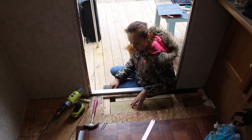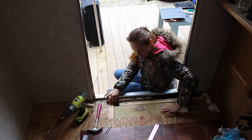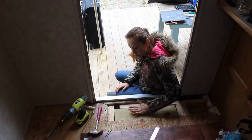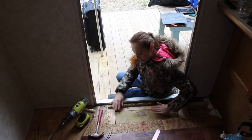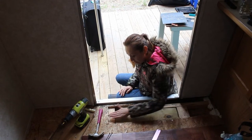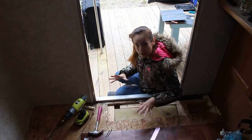In order to fix our problem, we put a brace underneath these two joints here and then added this piece of wood so that when people step onto this plywood piece it's going to help with weight — it's going to distribute the weight more evenly and we won't have any more of these vinyl tiles cracking on us.